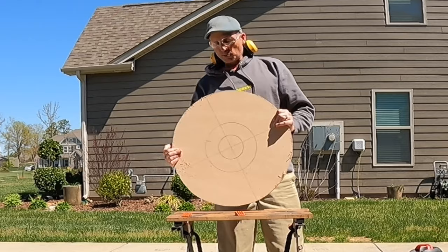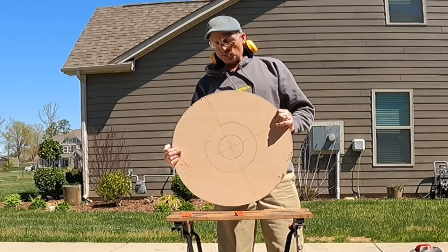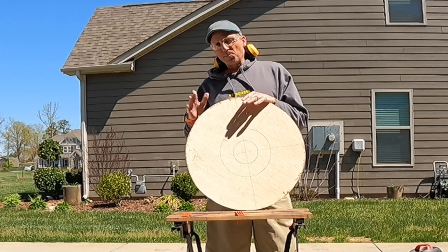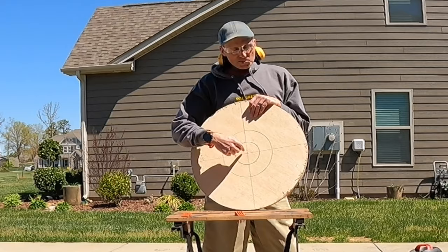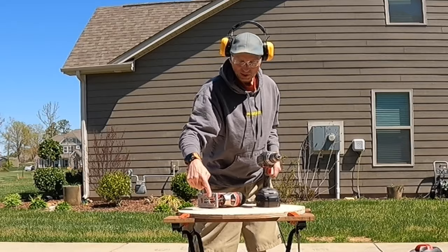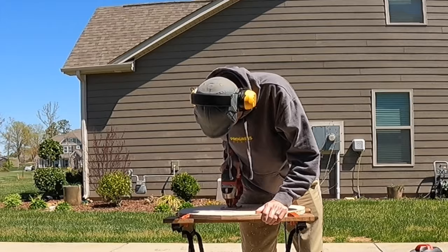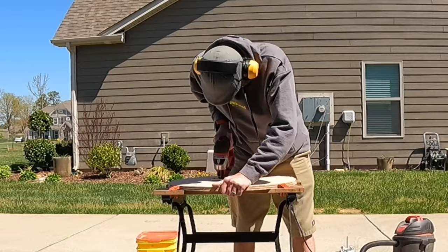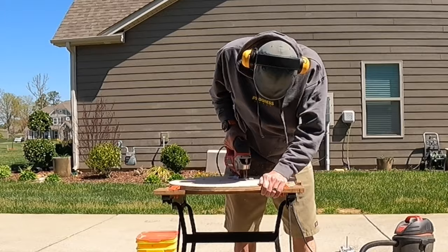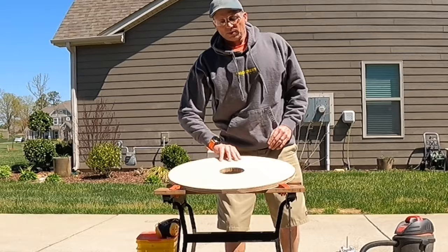It's more or less round. When you're using a circular saw you can't really cut tight radiuses - the blade binds, so you just go in so far, go straight out, cut it and redo it. It's just a lot faster. I didn't really want to get out my jigsaw and go all the way around - that takes forever - but I will have to use the jigsaw on the inside hole. First thing, we drill a pilot hole so we can get the blade in. Another hole, more or less round - not great, but good enough.